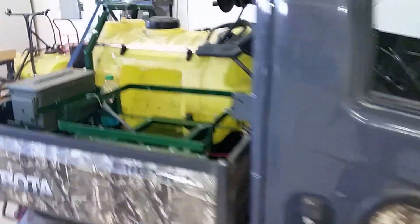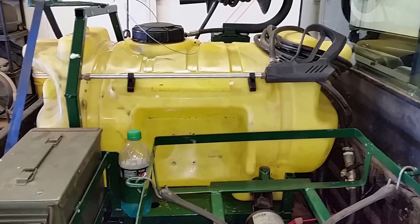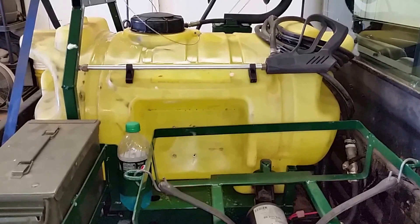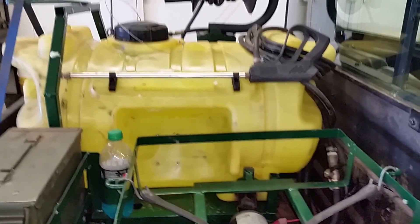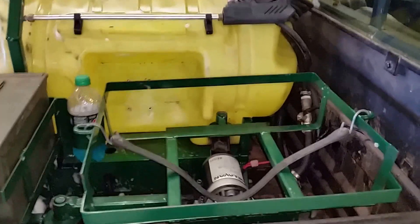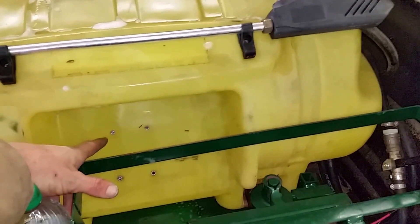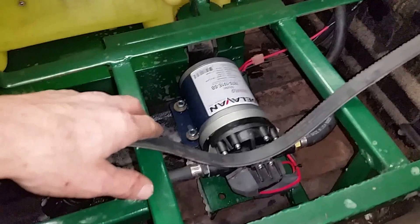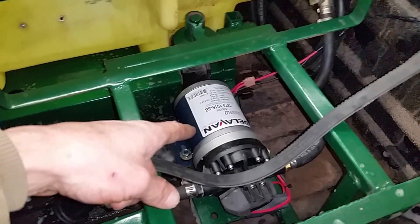So let's come back here to the sprayer. The tank and the skid are a 40-gallon sprayer I got from the farm store. The one spray nozzle you see came with the sprayer and it's currently installed as a backup. Normally these come with about a four-gallon-a-minute pump — not very much pressure. I installed a seven-gallon-a-minute pump that I have turned up to almost 80 PSI.